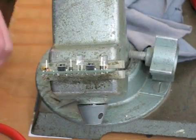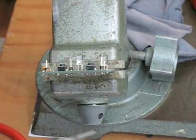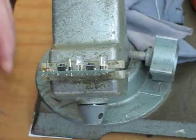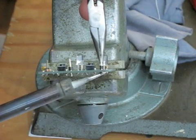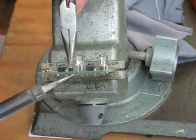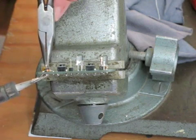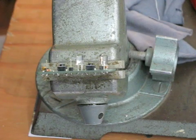Soldering the 3 header pins is a little tricky — they're separate and like to fall out easily. For this one, we'll lay the board at an angle that keeps the pins from falling out. Solder from the underside, which makes it kind of tricky. Take the pliers, keep the pin, straighten it in, and let it go. Repeat for all three troublesome little header pins.